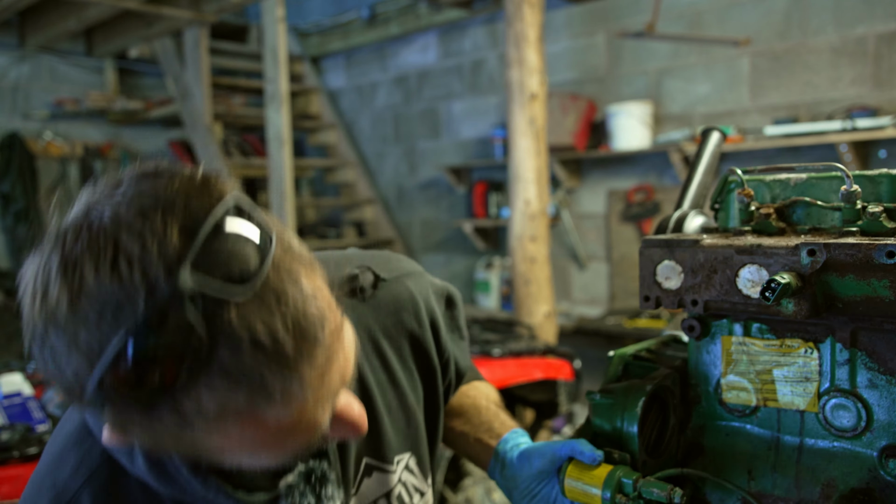It's also pumping out water on its own accord, not me forcing it into it, which is working pretty well. So I think the water pump's working well. Only issue of significance, which isn't really a big issue, is that the exhaust gasket is leaking, which is why there's water peeing out the top. It's not really a big deal for testing, because I swapped out the exhaust and didn't swap the gasket, so it's kind of expected, and I'll need to swap out that gasket. But yeah, she's pretty good.